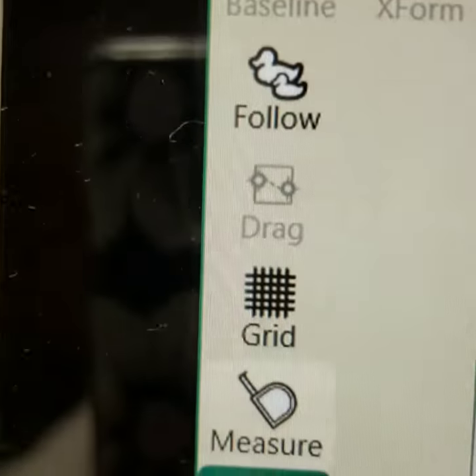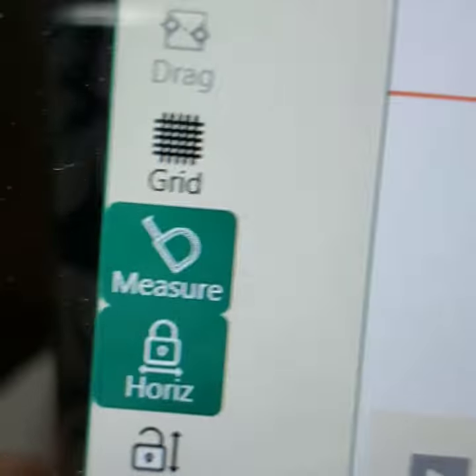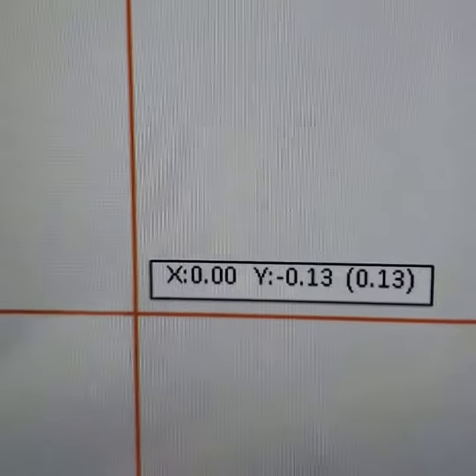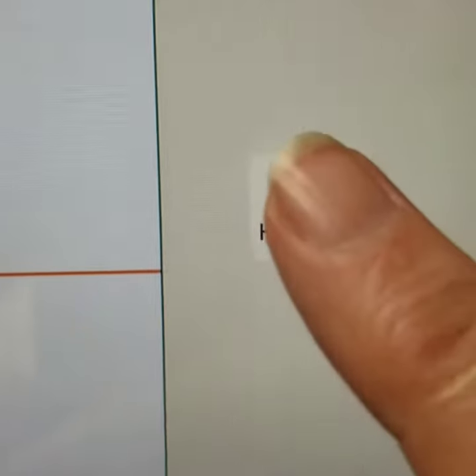Now I'm going to hit measure. I'm going to take the channel lock off and I'm going to move my machine towards me — you can watch the coordinates there, and when it gets to 0.25 we want to hit channel lock again.